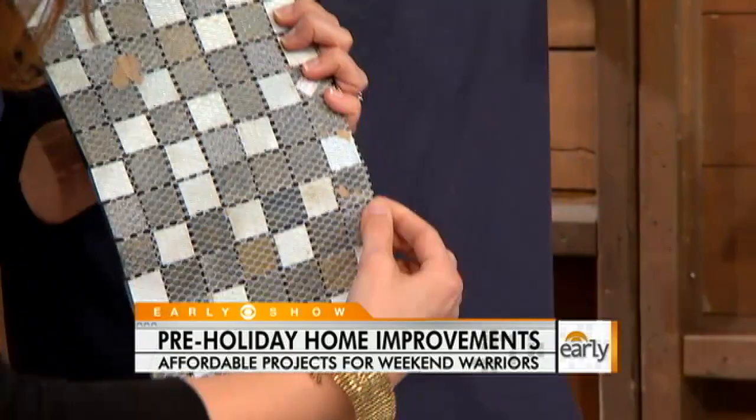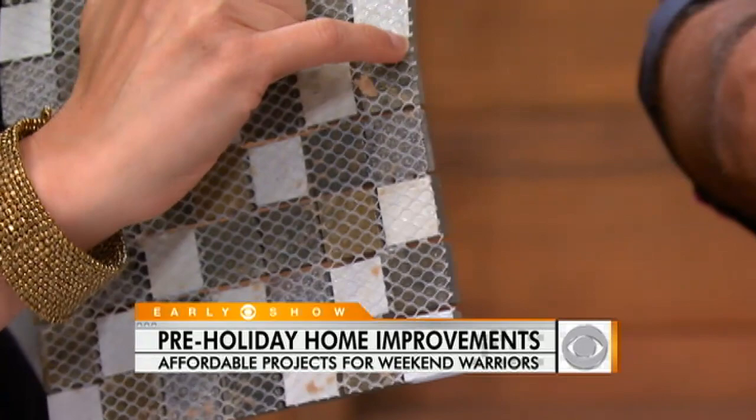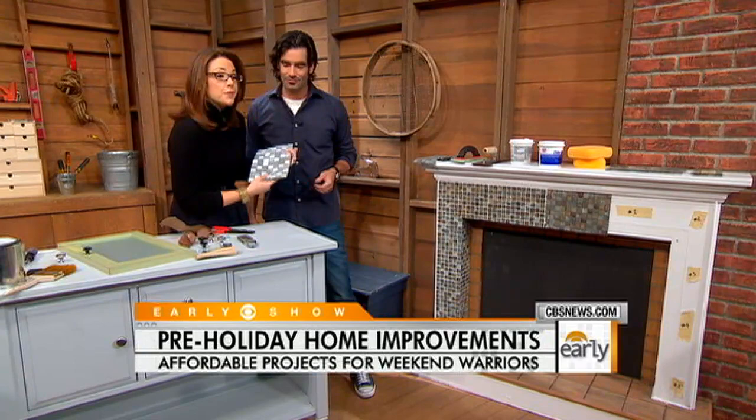He showed me something really important: when you cut the tile, sometimes there are little pieces that hang off on the backside of the mesh. Pay attention to those because they will fray and pop out once you put the grout in, and you'll spend so much time trying to dig those little pieces out. So look for those, or get some cuticle scissors to trim them. Also, work on your skills with the electric staple gun! Carter, great to have you with us. Thank you, appreciate it.